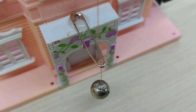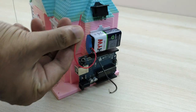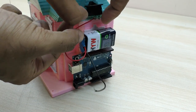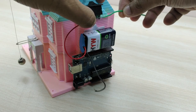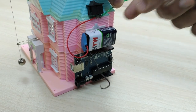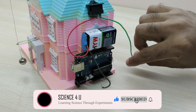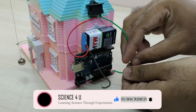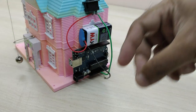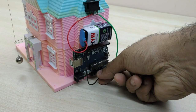This is the electrical contact that acts as a trigger during an earthquake, which you will watch later. Connect the positive terminal of the battery to one terminal of the switch. Connect the other terminal of the switch to the input voltage terminal of the Arduino board. Connect the negative terminal of the battery to the ground pin of the Arduino board.